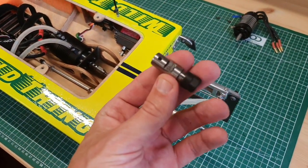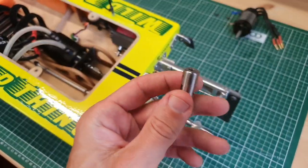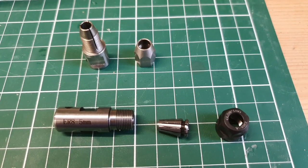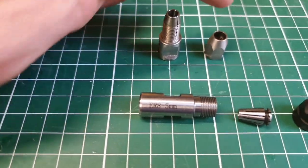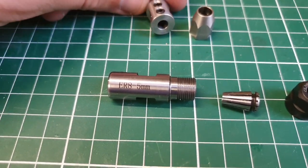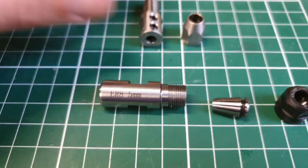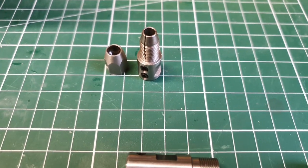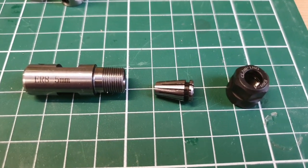Basically this is used to clamp down your tools for milling, so it should be high precision. Here you've got the disassembly of the two couplers. This is the original coupler — I believe it's from TFL — it goes from a 5mm motor shaft to a 4.76 flex shaft, and basically it works okay. And this is the high precision coupler.